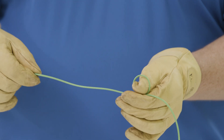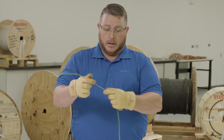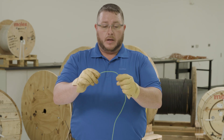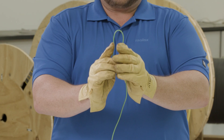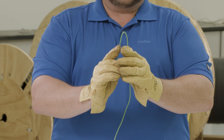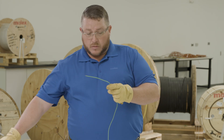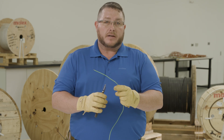As you can see, the buffer tube bends basically to the size of my thumb and there's no kinking, no damage, no issues with the fiber. Now let's say we took it far enough where we did break it — so we're going to bend this and eventually it's going to pop. Right there, the buffer tube has collapsed. What's unique is the polymers we chose to use are in dimensions and sizes where when that buffer tube is forced to fail, we don't want it to break the fibers.